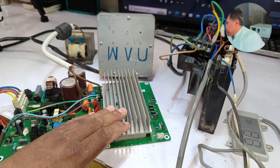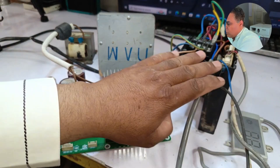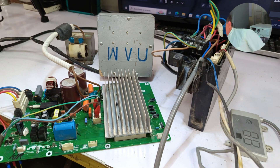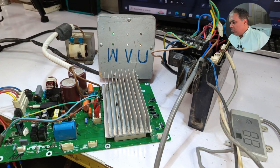I've now attached the heat sink to the IPM, so I'll check if it is still starting directly. The indoor unit is completely off and we are not turning it on at all, yet the IPM is still starting directly. Now I've reconnected the power and turned it on again. After the PCB completes switching, all the IGBTs turned on simultaneously. This means there's some issue with this PCB.